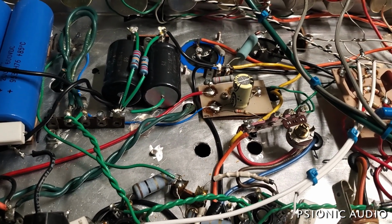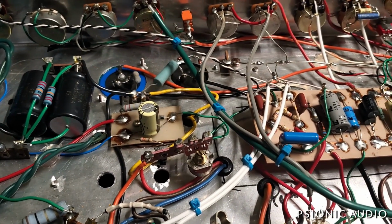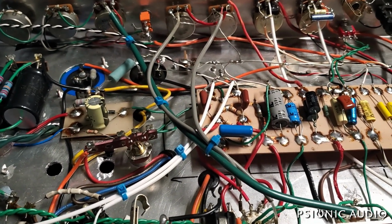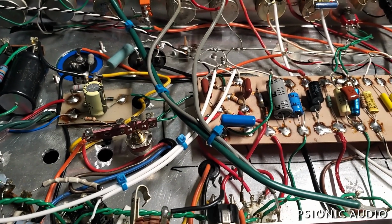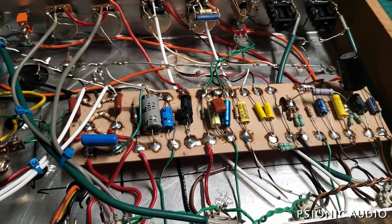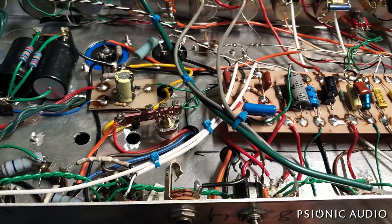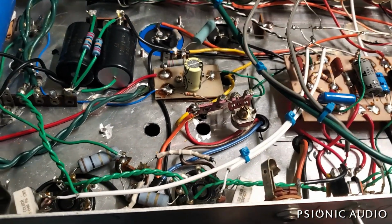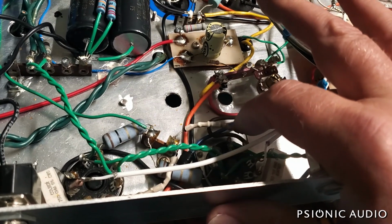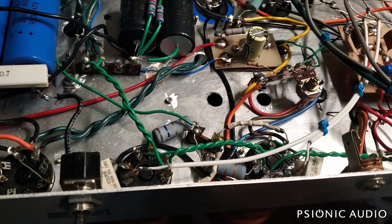It has, in fact, 2 chokes. Has a whole bunch of stuff here done to a level of quality that I personally do not subscribe to. Let's just say that. Things I would not do, things I would not find acceptable. All that said, while some fugly things are happening here, I'm not seeing anything in here which would directly lead me to assume that there is a fault causing a blown fuse, though I will verify these diode strings from plate to ground on the output tubes and verify a few resistance measurements.